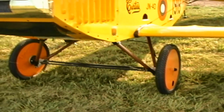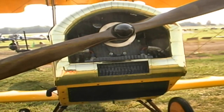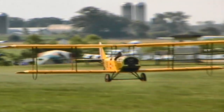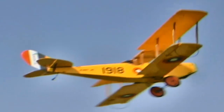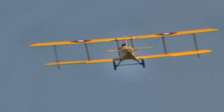You only get a net weight gain of about two and a half pounds in the whole engine with the gear drive, alternator, starter, manifolds — the whole thing is 135 pounds, about 60 horsepower. Performance versus the 503 is almost identical — it takes maybe eight or ten feet more on takeoff because of the weight-to-power ratio. It actually has more power but it's a heavier engine. Cruise is a little higher and rate of climb is about the same, so overall it's about the same.